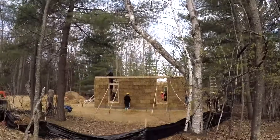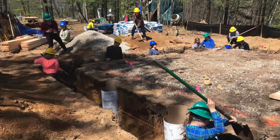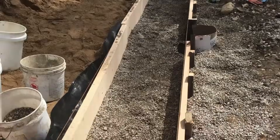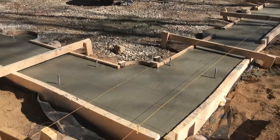One of the key concepts of minimizing carbon footprint is to minimize your concrete use. So the students and I excavated a big two-foot wide trench. There's 44 inches of washed stone, and then on top of that we poured a real minimal beam out of concrete — it's only eight inches thick.